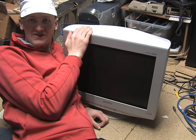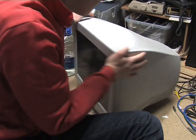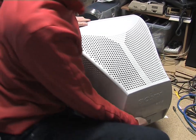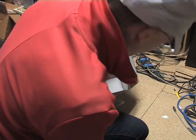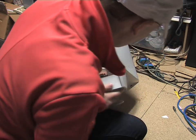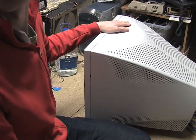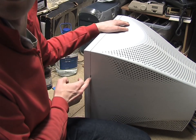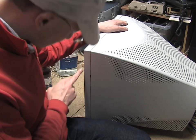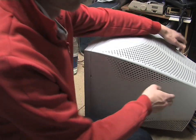The first problem is figuring out how to take it apart. If you spin it around to the back, there's a screw down there and an equivalent screw on the other side. If you're not familiar with how to take these apart, once you've undone that, there are some clips in the little holes on the sides of the monitor. Mine's covered in marks from screwdrivers where I've undone it before. You then have to try and unclip it and the back panel comes right off.